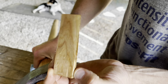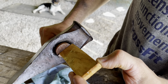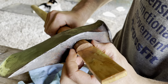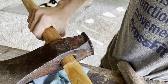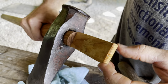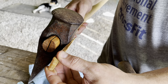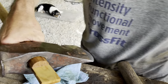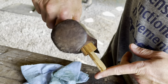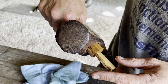Now I haven't even wiped off the excess linseed oil off of my wedge — I'm just going to leave it on there and I'm going to pound it in. Drive it in there all the way down as far as I can get it. Hopefully I've had this happen to me before where the wedge bottoms out and it doesn't give me a full spread like I need, but I'm hoping that's not going to be the case with this one. I think I might need to shorten my wedge a little bit — it looks like it might be getting too close for comfort — so I'm going to shorten the wedge just a little bit that way to make sure it doesn't bottom out.